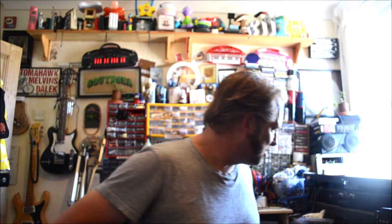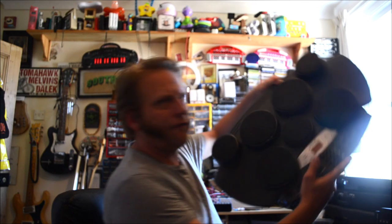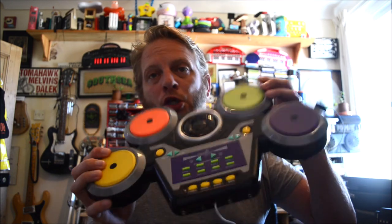trigger other things. So for example, my friend, silly little man, recently gifted me this humongous drum pad machine, which I am going to modify. And for each drum pad, I am going to wire in a mini jack that then can be triggered by the turntable CV kit. In addition to that, we've already tried this as a concept, so I know it works. This drum pad machine is one that came from a charity shop, a kids' toy, £2.50, but I soldered on a USB power supply, just 5 volts, to get it up and running.